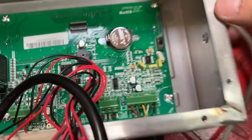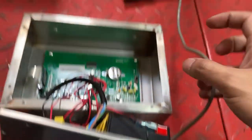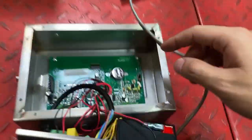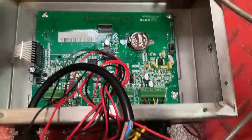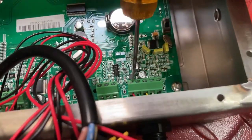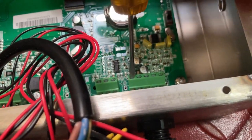This is a cable that comes out and goes to your column, through your column, and to the bench scale itself. It's important to get a mini flathead screwdriver, and you're going to start loosening up all the connections, because we want to actually remove the load cell cable.